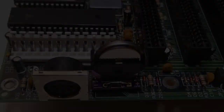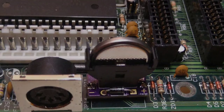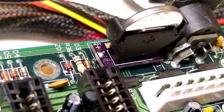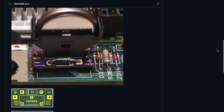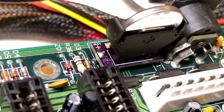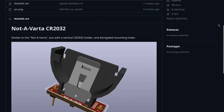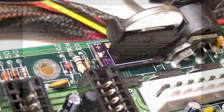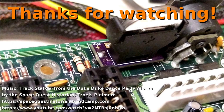Here is the final result. That's all for today. As with all my projects in this channel, this is open source and you can find all the files you need on the projects page on GitHub. After filming this video and while browsing theretroweb.com, I came across a very similar project by wiretapretro called Natavarta. The design is quite similar but it uses a MAX 40200 ideal diode which may work better than the Schottky diode due to its zero voltage drop. The downside is that it consumes about 7 microamps, which is comparable to the consumption of the clock chip. I hope you enjoyed the video and as always, thank you for watching and goodbye!